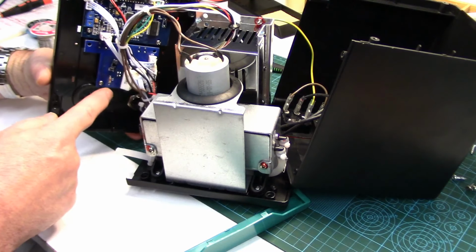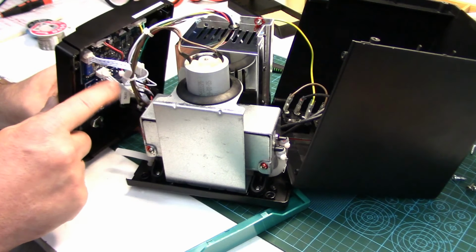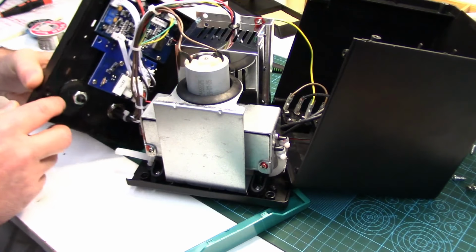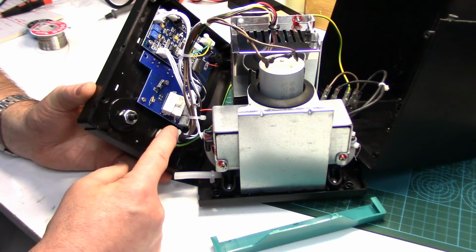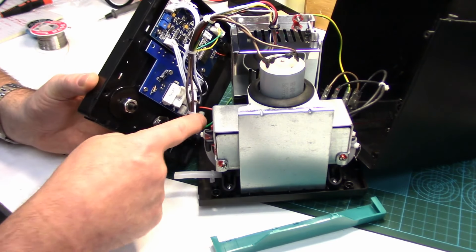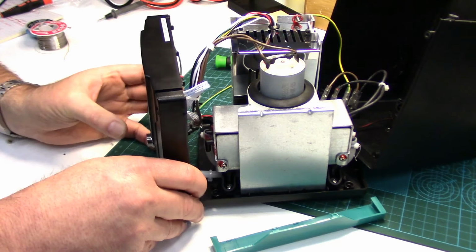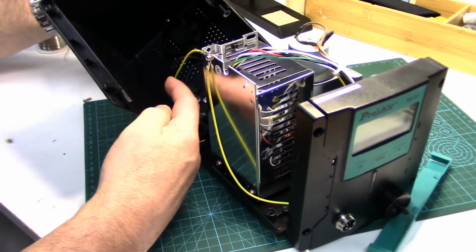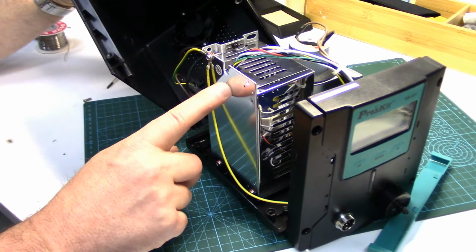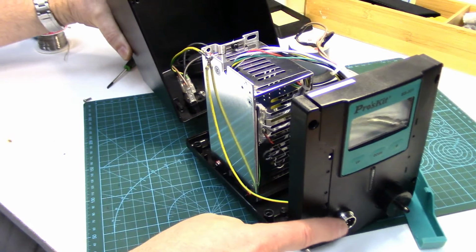There's all our control interface. We've got our switchboard and the actual logic board for the display as well. And really nice to see all the GX solder connections. Here they've all been heat shrunk, so they're all nicely insulated. All the wire management is tied off. Yeah, it looks pretty good. As far as grounding goes, there's our grounding wire in from our C13 connector. Here's our power supply, so it is grounded, switch mode power supply. And then another ground strap going to the housing of the GX connector.